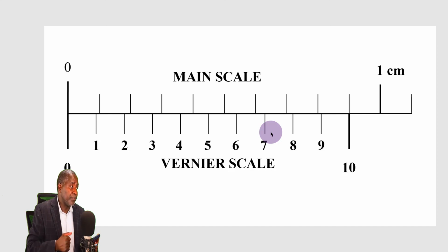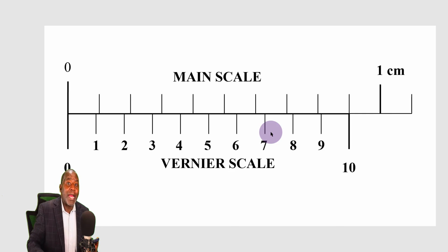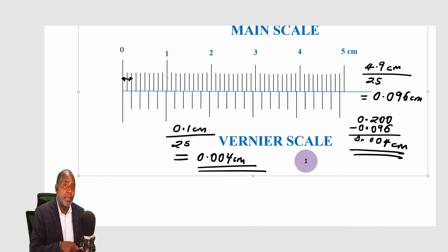So in this video, I just want to recap a few points: that we are able to divide 1 millimeter into several divisions, even if they are 10, 20, or 50 divisions, and we are able to read those values accurately when we mark that scale on the Vernier calipers. And that is all that we have for this video. In the next video, I'm going to look at how to read complex scales of the Vernier scale.